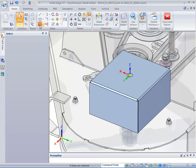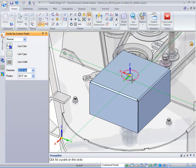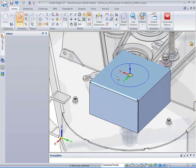You can see that we have the bolt sticking through the top here where the pulley is. So we're just going to come up here and sketch a circle. Size isn't important. Just come up here and hit the dimple using the default values to dimple that material up to create some clearance.